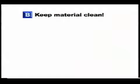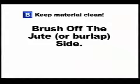Do not reverse lay. Keep material clean. Be sure to brush off the jute or burlap side, also known as the adhesive side of the material. This must be done in order to ensure the adhesive sticks to the wall and not to any dirt.